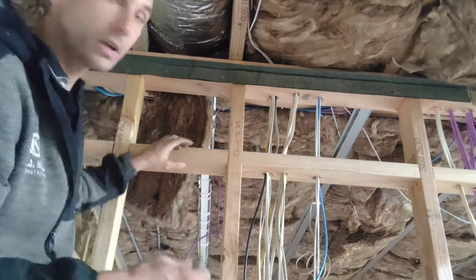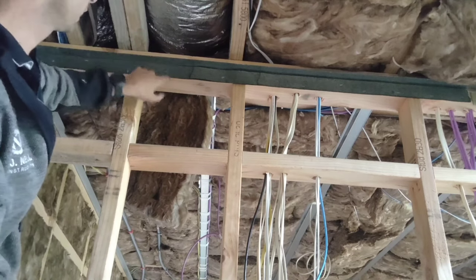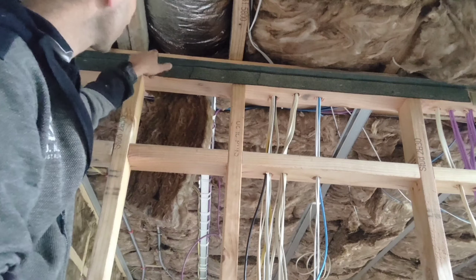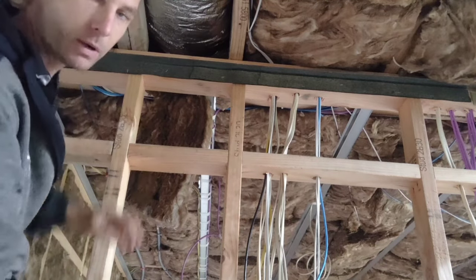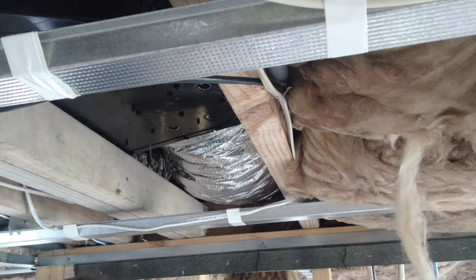For this side, a strap won't work because you have your strap going over — it can't then go over this and attach to the studs. So what I'm doing here is using these instead to fix down to the top plate. And since this is a load bearing wall, there will be a stud lock screw that goes from the top plate down into the stud anyway. There is the head of the stud lock screw which goes down 80mm into the stud. I need to do this a wee bit blind, but it shouldn't be too bad.